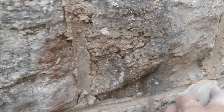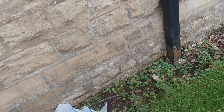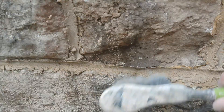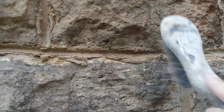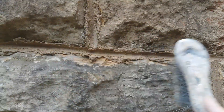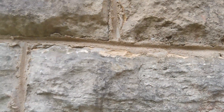Press it in and work it round, and then you need to get a bit of a brush. An old brush. A lot of people get a churn brush and start whacking it back — well that's just nonsense. All you're doing is brushing those bits off, pushing any loose off. There's no need for all that banging because your stick's pressed it in when you were actually pointing.